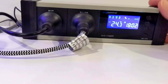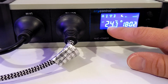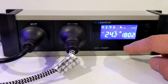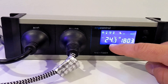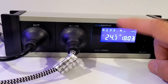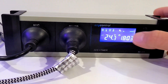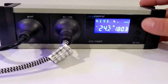I put a light to help some algae grow for these fellas, and you can put two different types of schedules on this one. It's pretty full-featured — you can set your desired temperature, heat or cool mode, daylight and nighttime settings. You can set what tolerance you want: say if I've set 25 degrees, I don't want it to vary plus or minus three degrees, and that's when it'll kick on the heating element. There's also an alarm you can switch off.